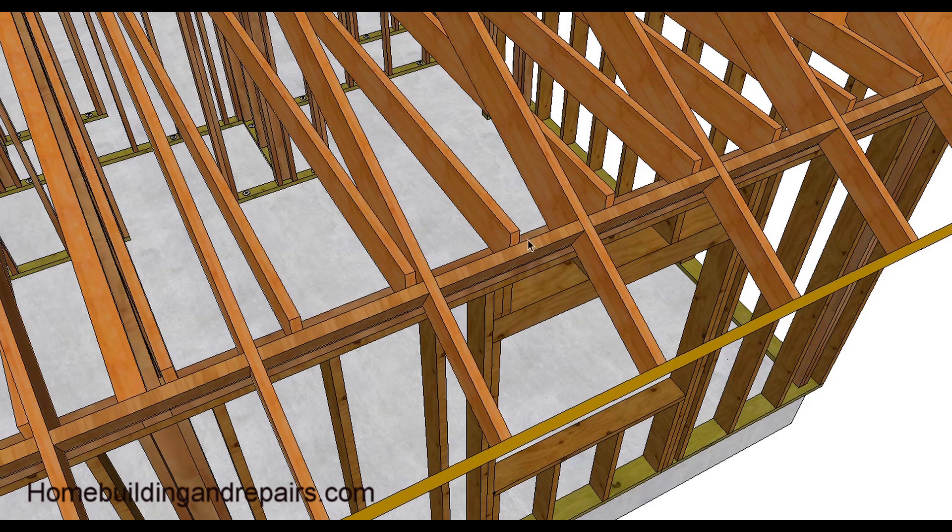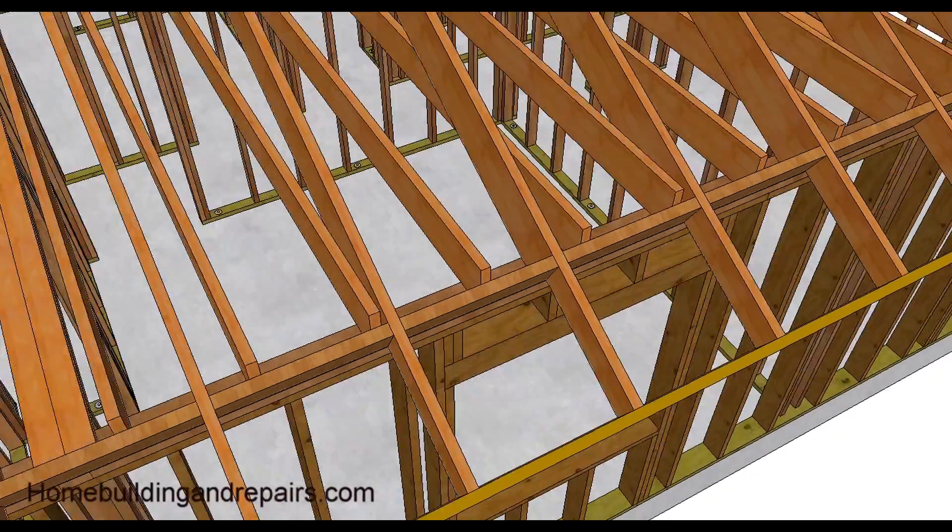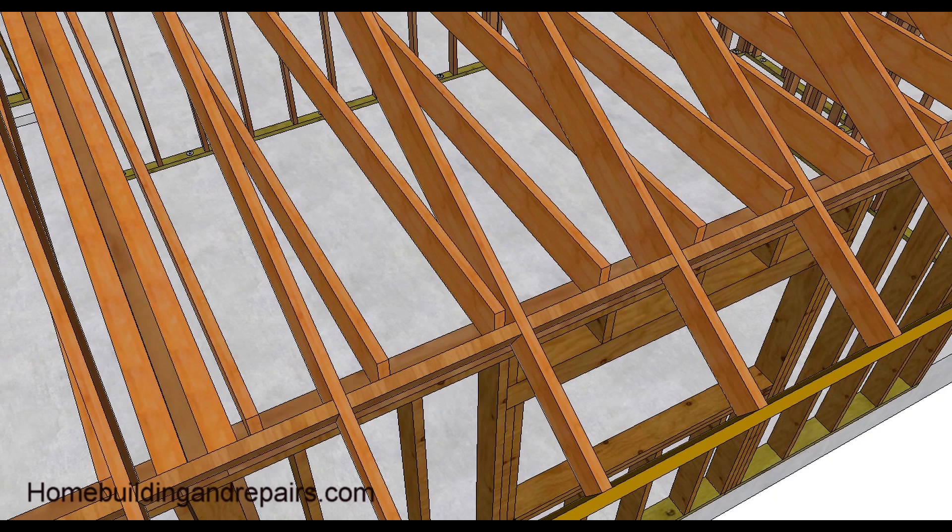Let's talk about the ceiling joists. The ceiling joists here are 16 inches on center. The rafters are spaced two feet on center. Every four feet we are going to need to connect the ceiling joist and make a connection with the other side. So at zero inches, then 16 inches, two feet, 32 inches, and then 48 inches — so four feet would be every other rafter on two-foot centers and every third rafter on 16-inch centers. Again, these need to connect — they are basically holding the building together.